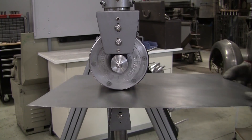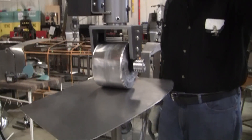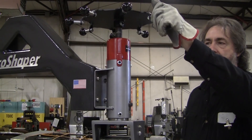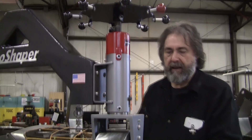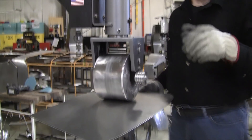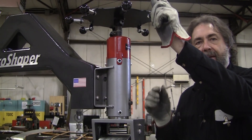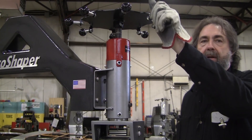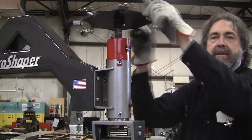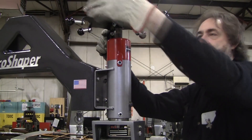So what we're going to do is navigate through the panel, and we've got a pressure. On all my wheels, I have one red marker on my wheel to find out where I'm at. So I'm here, and if I kept wheeling at that pressure, it would probably take me about three years to make this panel. The machine is giving me feedback that I don't have enough pressure. So I need to increase the pressure — I could increase it way over here, but that might be a little extreme. Let's take it a little at a time, going from about 9 o'clock to 12 o'clock.